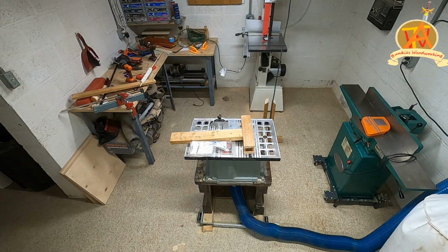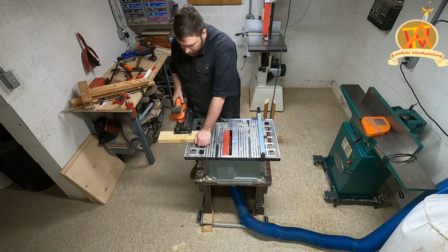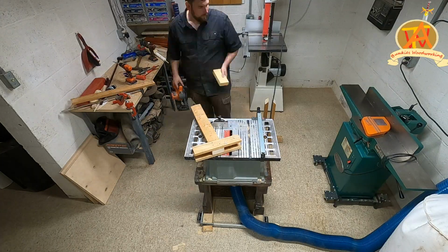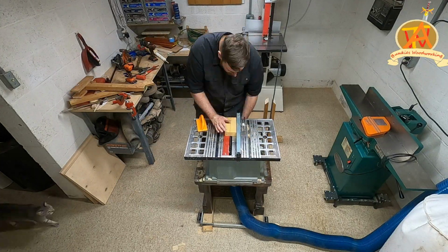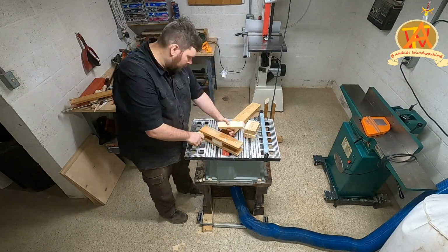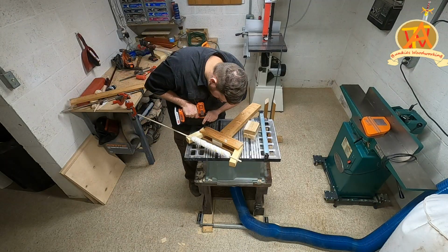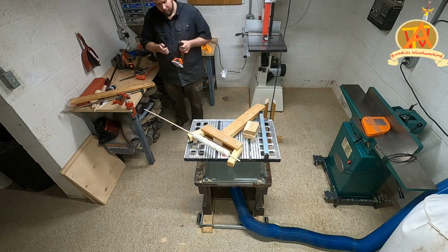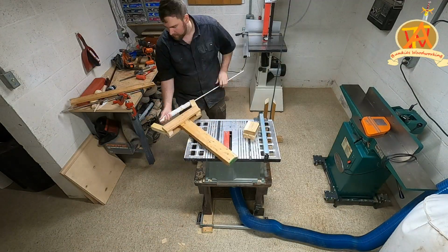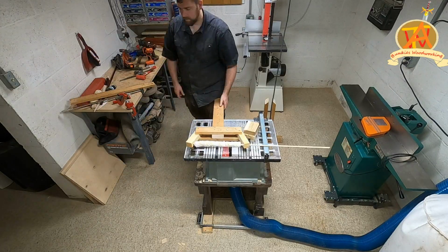So I went ahead and cut a 2x4 about 6 inches, and then I pondered what I was going to do next. We remembered our drawing and thought of making a V. Tim started ripping a 2x4 in the middle. Then I positioned the dowel rod in order to make a hole through the V. Then I connected the ripped 2x4s to the stand. I cut holes into the V in order to run the dowel rod. Once the dowel rod was completely through, Tim had to cut the remainder of the dowel rod.